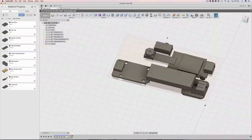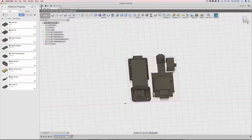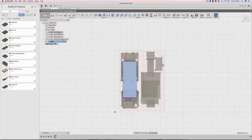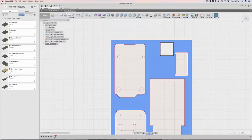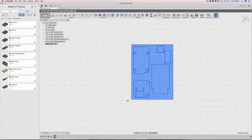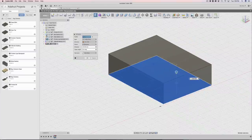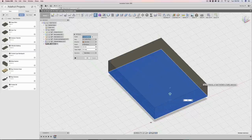Now I'll activate the case and extrude this out to make a box. I'll hide all the components using the V shortcut. Now I have all the profiles. Use a window selection - not selecting individual things - and go this direction to select more. Hit E on my keyboard and extrude it out. I don't know how big it needs to be yet, so I'll just put 10 millimeters and I can adjust later. Now I have the sketch and the extruded box.